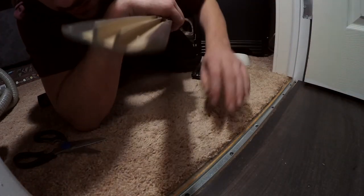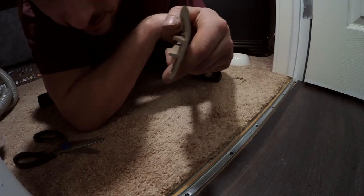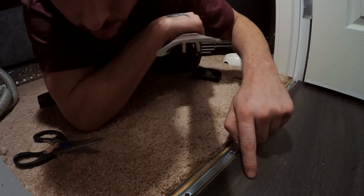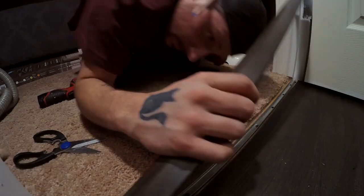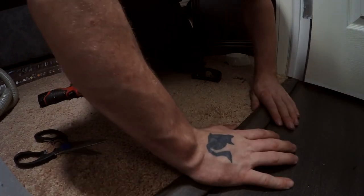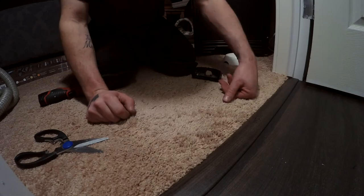Okay, we're almost done. So now you just line it up — see, there's a little channel there and there's a channel down here. This is called a reducer piece. See how it kind of goes down on one side? This side goes on the floor and this side goes on the carpet. Line her up — easier said than done. Line up the other side and I found it easiest if you push down in the middle. And guys, that's looking all right!